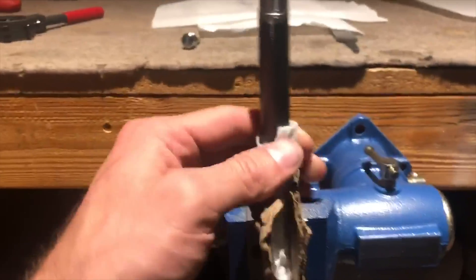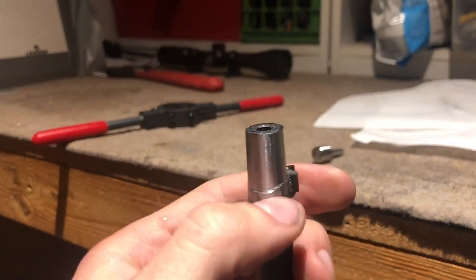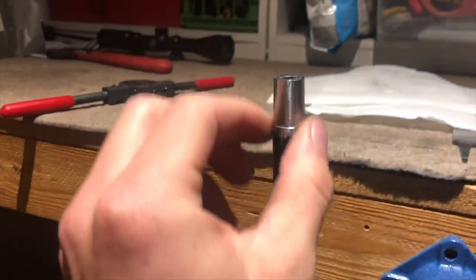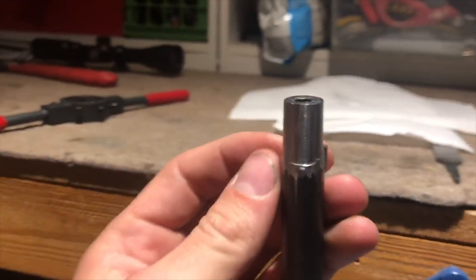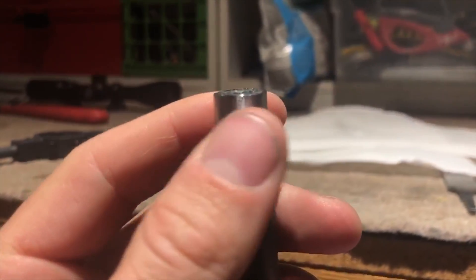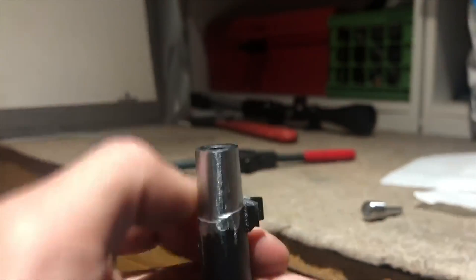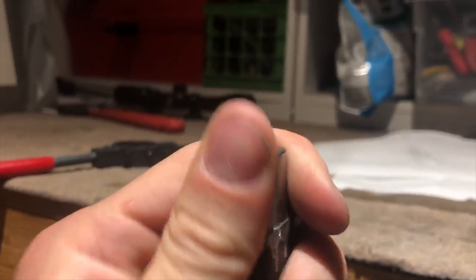Let's take a look at what we've got so far. I got it wrapped up so the oil doesn't drip down when I get to threading. You'll notice there's kind of a notch down here — it's because the barrel is slightly tapered, so it's wider towards the bottom than at the top. But this is pretty close — I'm still going to sand it to get it smoother, but that's almost exactly half an inch and I'm really happy with that.